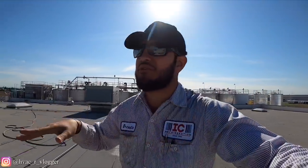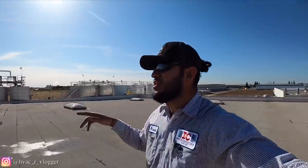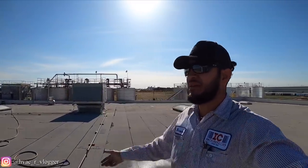All right, so this is what's going on. This place, they take care of their own filters, so they just replace them. So we don't have to worry about the filters. Also, the belts, they replace their own belts. So basically, all we're doing today is checking electrical, checking pressures, temperatures, washing coils, and that's basically it.